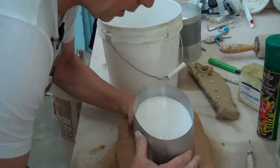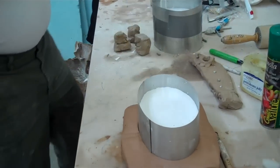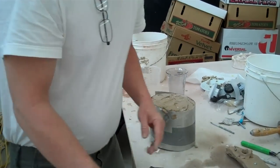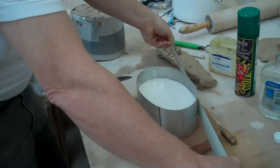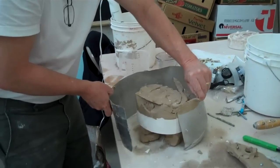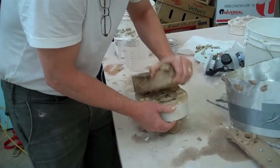When I'm done, what I normally do is just tap the side of it and lift it up, and you can see air bubbles come up. So now when we're done with that, what you do is take the mold, turn it over. Sometimes on the mold, if I have to, I will use duct tape — I forgot to tell you that part. I will duct tape around this. This mold itself is so small that it doesn't matter, but I will duct tape around to hold it. Now it won't come out. So then when I'm ready to take it off, I can just take this off. A lot of times I'll just take the clay out from the inside and leave the cottle along so it's all even.